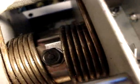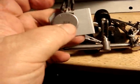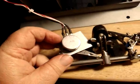Okay, first thing I'm going to do is clip this tie strap loose here to give me a little more play with the wires that are hooked up to the pot. That way I'll be able to set it up here and use my little helping hands. So what I'm going to do now is put it on here, and I'm going to cut the heat shrink insulation back on the wires so I can unsolder the wires.